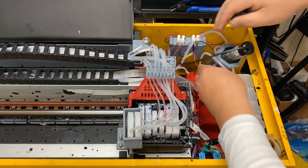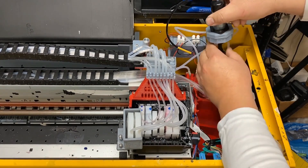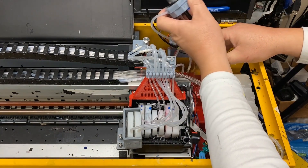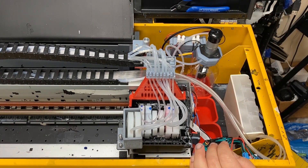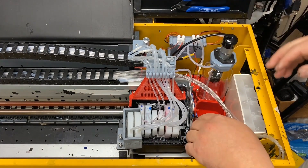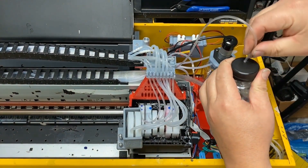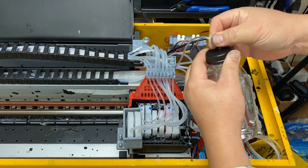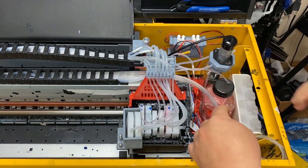So basically it is a management system by itself. This printer was designed so that whenever you turn the printer on, the stirs run permanently, just constantly creating noise. So put that power into this gray box and let the gray box manage it — you'll prolong the lifetime of your stir and the pump, and it's a lot less noisy. I do have another video showing you how to install that box. If you use it almost every day or every other day, just use distilled water; if you print every couple of days, you can use a capping or diluted water solution.